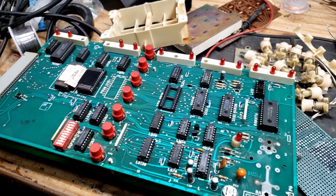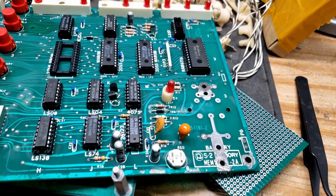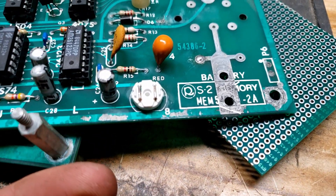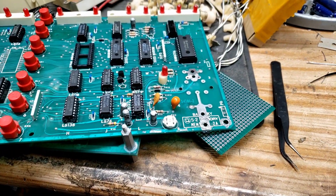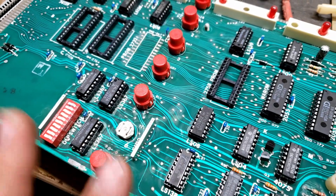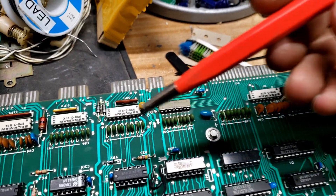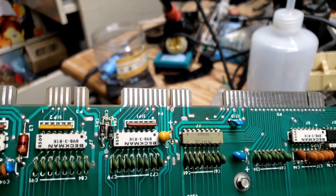We'll just leave it all together, pull out these EPROMs, and throw this thing in an ultrasonic cleaner. I was really hoping that would fit — I guess that's why I have a big one. We're looking better but not perfect. It's still a little wet up there; it didn't dry fully in the oven. That looks a little bit better now. Still doesn't click — I think the springy part's dead. Let's pull another one of these off just to compare and see what it's supposed to look like. The spring is stuck down. I think just popping that out will probably fix it — and we got this one clicking again. I'm going through cleaning all of these contacts with a fiberglass pen since they still had a little corrosion, making them shiny for good conductivity. Now I'm going to clean the pads on these connectors with the fiberglass pen, to hopefully prevent that issue where touching the cable caused the re-initialization problem. Now that connector looks good as new.